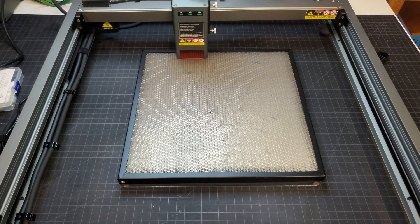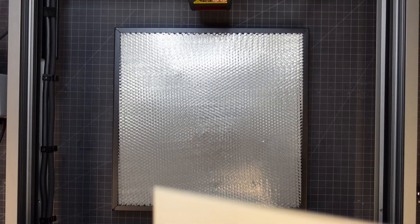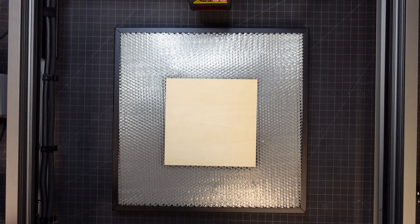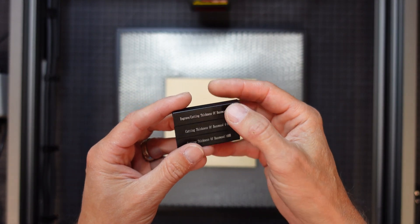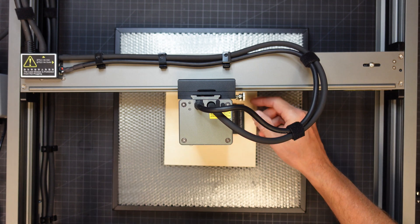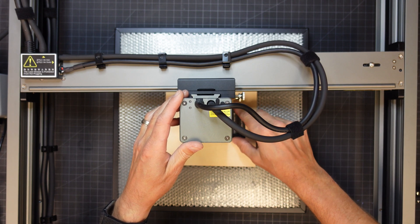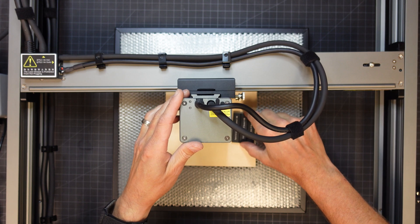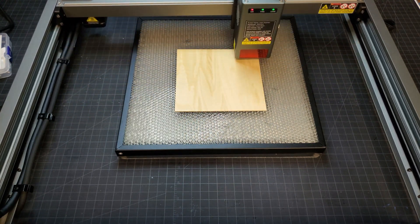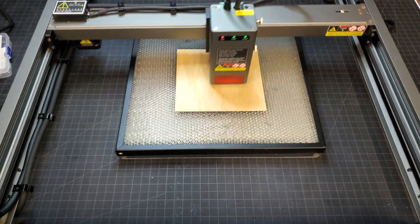We're using LightBurn software, but the laser also comes with Laser GRBL, which is open source and free to use. The laser connected to LightBurn with no issue, and I framed a sample job just to make sure it was communicating. You set the laser's focus by getting the thickness of your material and then using the manual focusing tool to set the laser head's height — the thumb screws are loosened, you position the head on the correct step on the focusing tool, then tighten down the screws. I noticed how loose the laser head's bracket was, which didn't seem right, but I couldn't see how to tighten it down. I also had a hard time seeing exactly where the laser would be hitting — I'm used to seeing a red dot on our CO2 lasers to know their exact position.